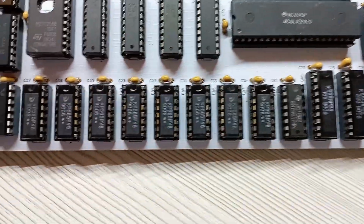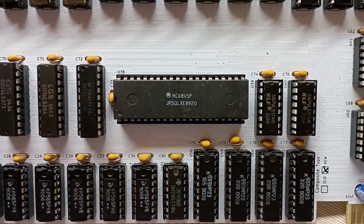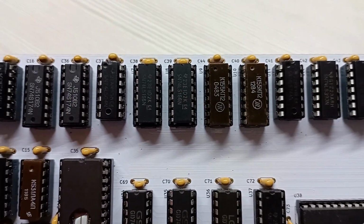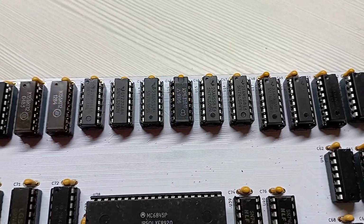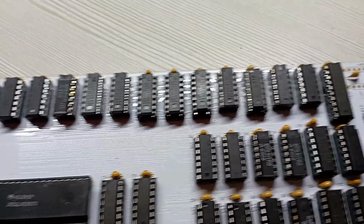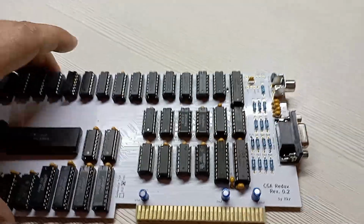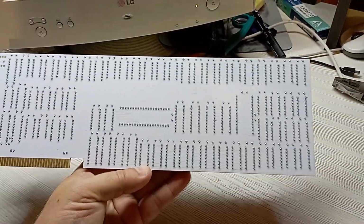I used Soviet memory based on the RU6, a clone of the original Intel 2118. I got the CRT controller from Avito, because the controllers from AliExpress, while they do display an image, do so quite poorly and crash the system in some modes. The card didn't require any fixes, which is really good.